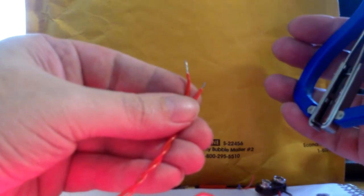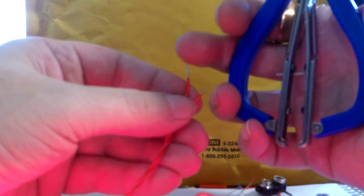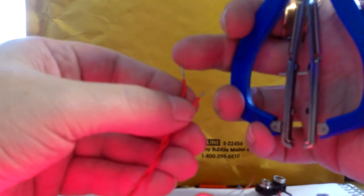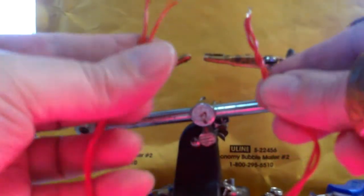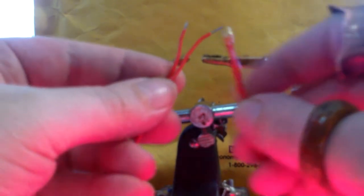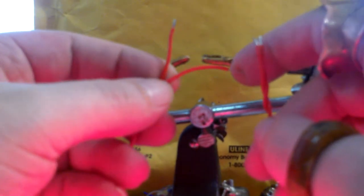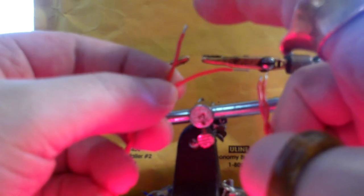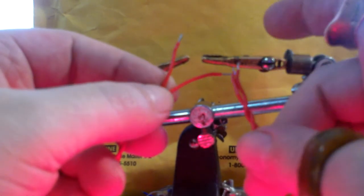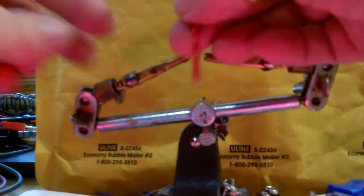So this one is about a half inch, and this one about three millimeters or an eighth of an inch — so about a centimeter basically for the long one. Now we've got our two sides with the wires: this side has two wires that are even with each other, and this side has two wires where one is longer than the other. The long one we're going to leave and solder in a couple of minutes. These three we can tin.